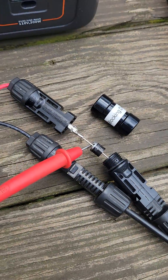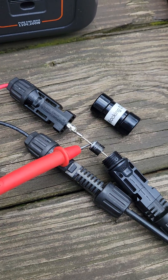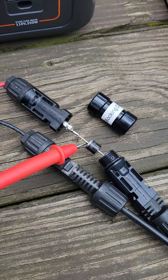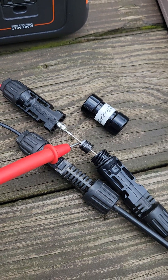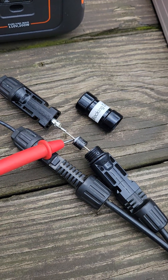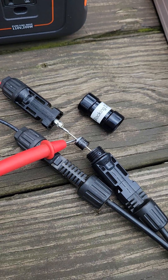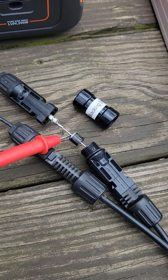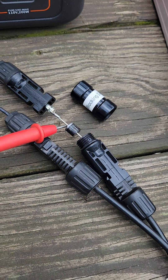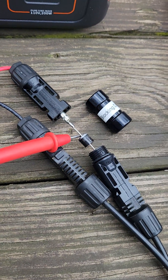The other reason I would use this is because I have a power station that doesn't have a blocking diode on the MPPT. You may have come across those — if you have a super cheap, no-name brand power station and you put your solar panel out there and it charges nice, the minute a cloud comes by or you walk past the panel or anything happens to unsettle the MPPT, it will stop and then reverse and feed the battery power back into the panel itself. You'll come out an hour later and find your power station drained even though it's sitting in the sun. If you add this blocking diode — this is an MC4 blocking diode you can just stick right in line on your positive side — that'll stop that reverse flow from happening.